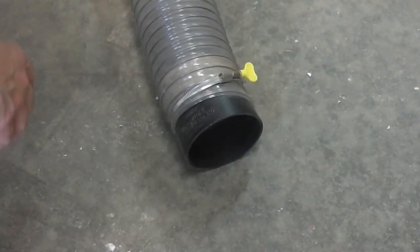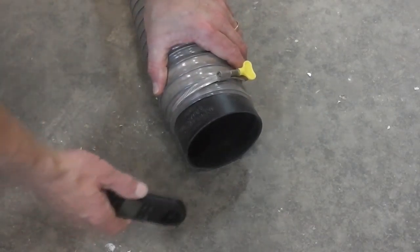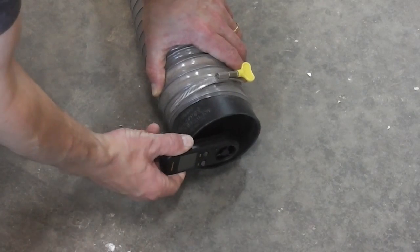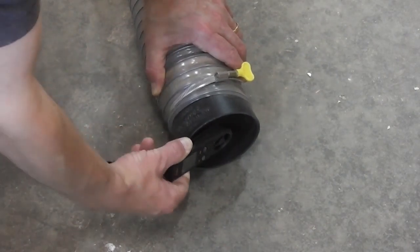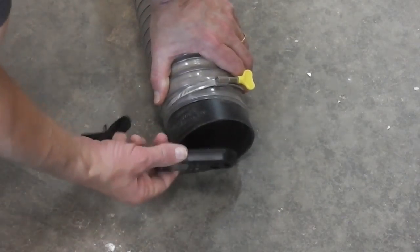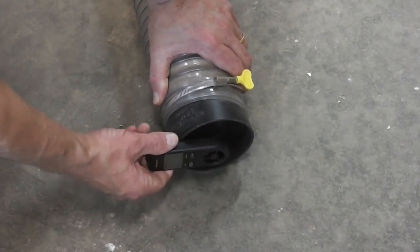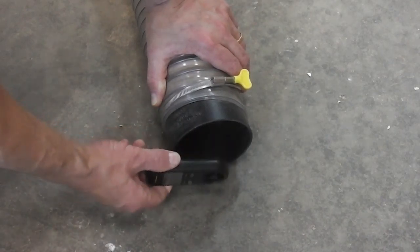Let me show you how I'm going to test the hose. I've got the hose laid out on the floor about where my table saw would be. All I'm going to do is turn the dust collector on, take the anemometer, and hold it pretty much as low as I can, right in the center of the hose. If I dip it in or out, it's going to give me a different reading. Again, this is all very unscientific, but it will give me a good general idea.